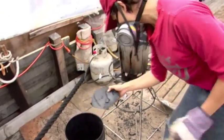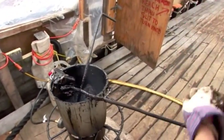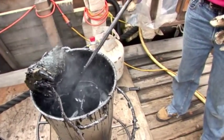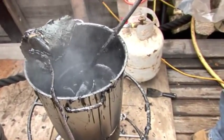The more formal name for it is marine glue. Actually what it is is tar, and we have to break this up in chunks, and we put it in the pot, and we melt it down, and we pour it into what they call pitch pots, and we begin to pour it into the seams, and this is what's going to seal the deck ultimately from the rain.